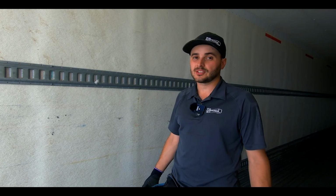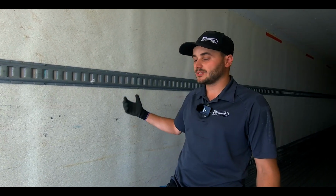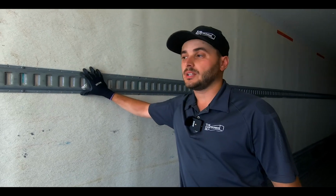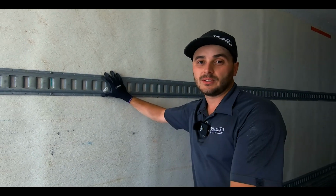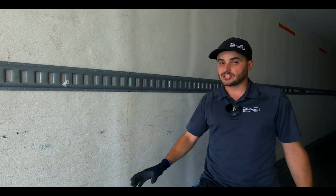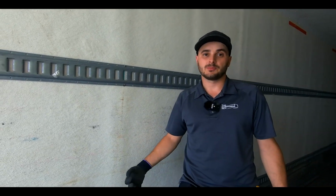Lastly, installing electrical in these is often cheaper because we don't have to strut line the interior. We can fasten our conduit to the wall and not worry about penetrating through to the outside. So electricians often can come right in here and start piping in their electrical switches, plugs.